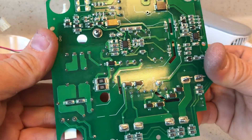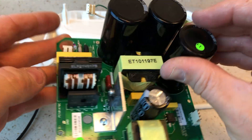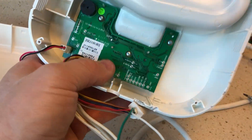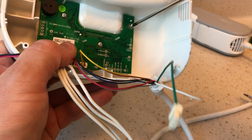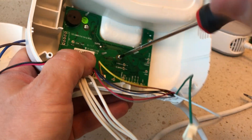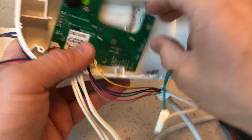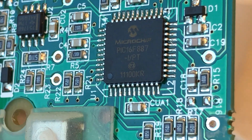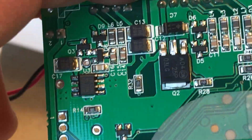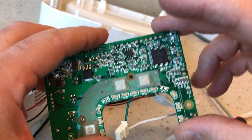Here's the board in isolation — that's providing the power to the lamp. It's not as sophisticated as the one in the other video; it's a very simple but quite hefty power supply board. On the other side of the unit we have this control module, which looks like it's connected to some buttons. There's probably a microcontroller and a few LEDs, since we saw lights on the buttons. Zooming in — microchip PIC16F887 — we saw that on the other one — and a few other components. That's the main control board.